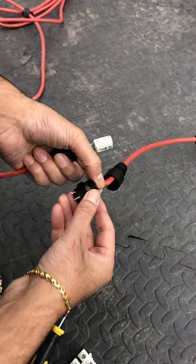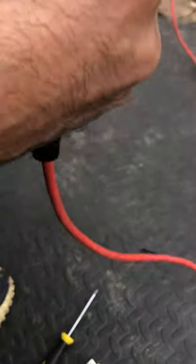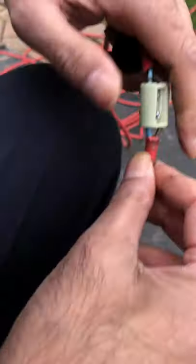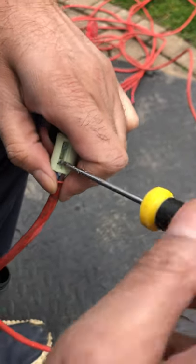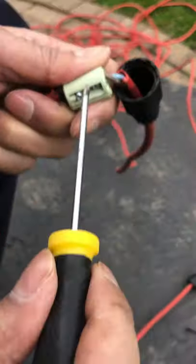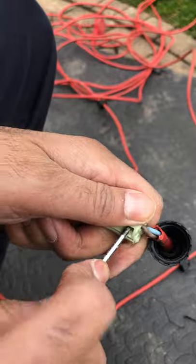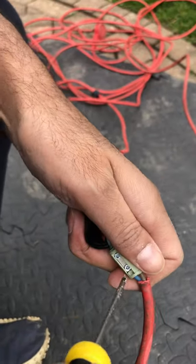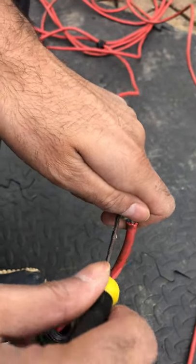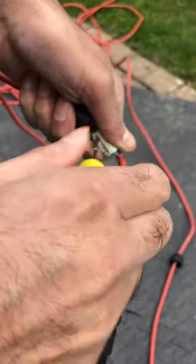So that should go in okay there. Now we need this part as well — I'm going to put that through there so it's ready to connect to this side. Now I'm just going to do the other side again. I've got the blue wire, I've got the brown wire, and basically just twist it that way — neutral and live, just going in there. Okay, that one's tight. Same for the brown. Make sure all the screws are tight. On this one it's actually a three-port one, so if you had a neutral wire you could just put it on there as well, but we don't need one in this long wire.